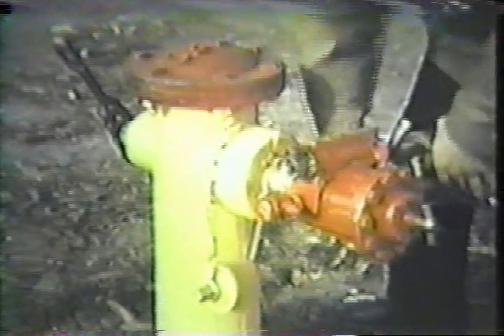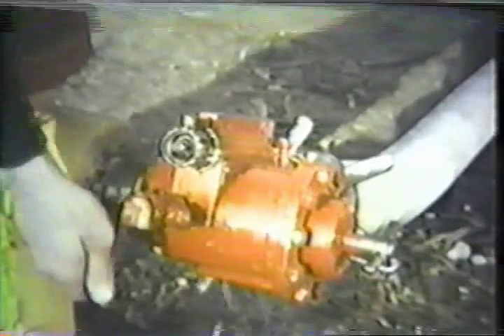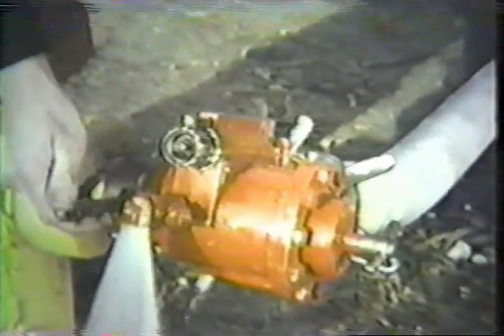A Gleason valve is used to reduce the high pressures encountered at some hydrants, on high-pressure tap-ins, or in relay pumping operations. The indicator should be set at the desired pressure before starting the flow of water. Water discharging from the overflow indicates there's sufficient water to maintain the pressure selected. An immediate shutdown can be made by simply cracking the emergency petcock. After shutting down, a discharge line can be bled by opening the bleeder valve, and the oil hole shown here is for lubricating the piston.